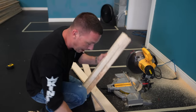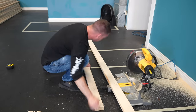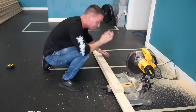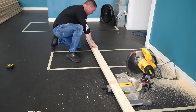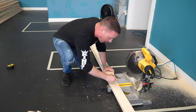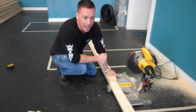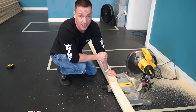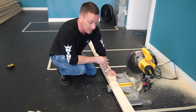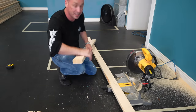Remember, these are not actually four or two inches thick. How many 2x4s do you need — is there a rule of thumb? I'm happy to say yes. I've built so many stands and so many different types of tanks over the years that I can go to a lumber yard and know exactly how many pieces I need. For a three-foot-long stand, you'll need about eight 2x4s. A four-foot stand: ten. Six-foot: twelve. Eight-foot: fifteen. And you guys are going to be able to do all of that just based on this one video.